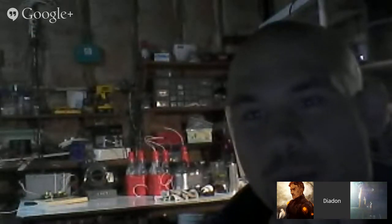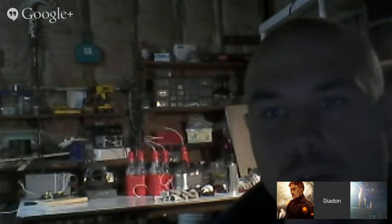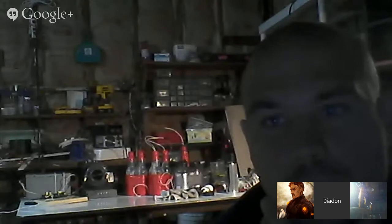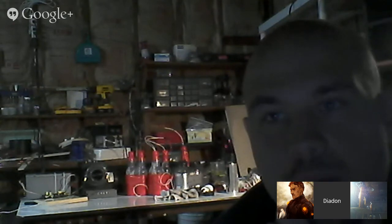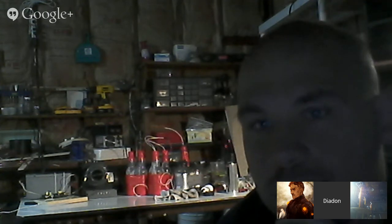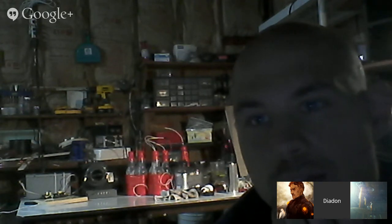I was planning on running my L3 self-looped from what would be the primary in the original circuit. Any suggestions? Self-looped from what would be the primary in the original circuit. Oh, I see what you're saying. Looping it back in to the primary winding. With a Slayer, maybe a diode, so the primary windings don't just jump into L3. If I understand the question correctly.